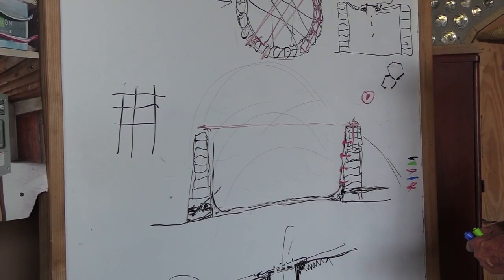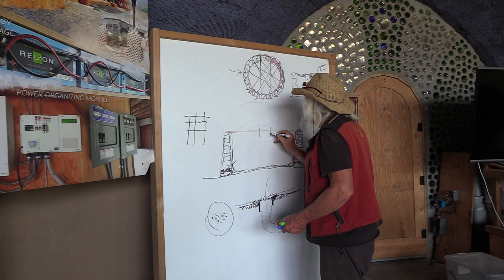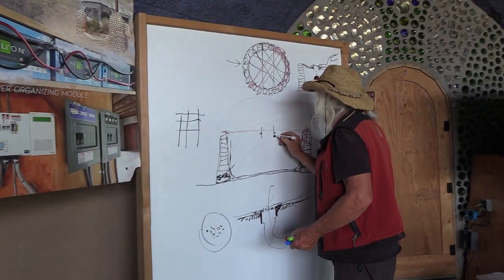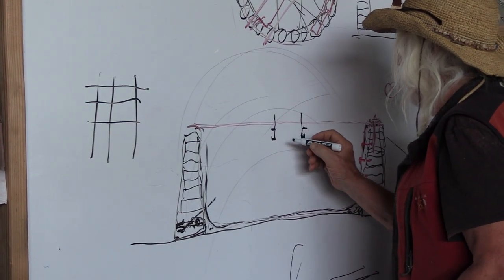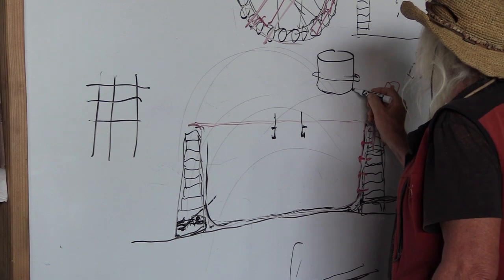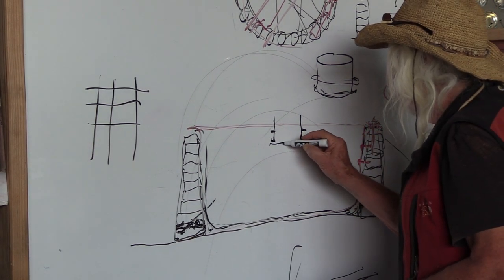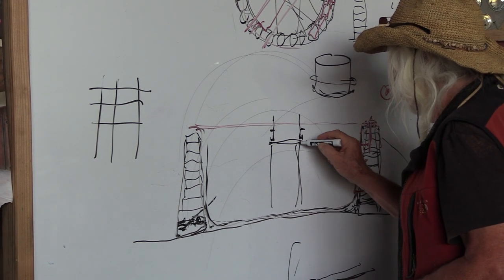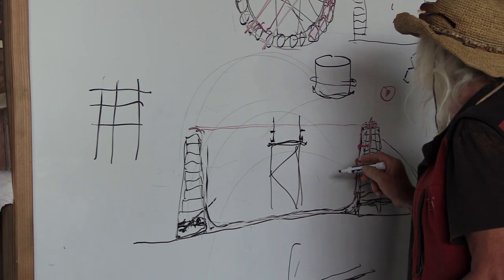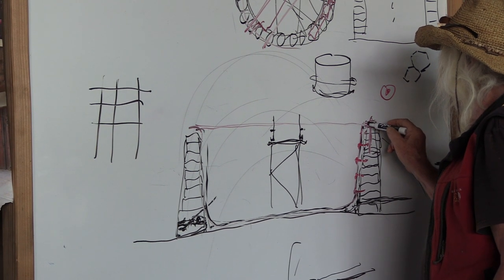We have what we call a cistern hub — it's like a manhole. It's made of eighteen-gauge metal with a little lip and a trough, and it costs about a thousand dollars to have made at a welder shop. It's a cylinder with a lip all the way around and a trough below that. You set it up on a little two-by-four tower with braces, placing the attachment lip about three or four inches lower than the top of your Trex two-by-six plastic wood.